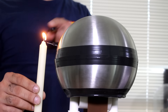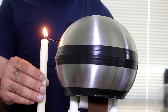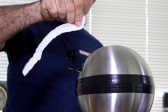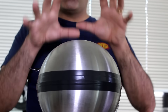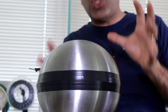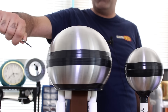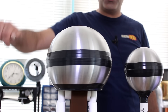Although it seems like half of the flame is getting attracted to the nail and the other half is being pushed away — well, a flame is plasma, or ionized gas, which means it has both positively and negatively charged particles. So some get attracted and some get repelled from the point. This napkin shows the charged wind better. In any case, having a spike or sharp edge results in charges running away and the voltage drops. That's why the arcs are much smaller now, and why we try to avoid sharp edges in the dome. Similarly, if I bring a sharp object close, it quickly sucks away the charges from the dome without any visible arc, and the voltage significantly drops.